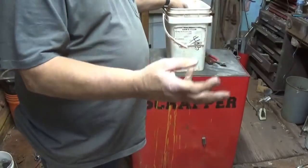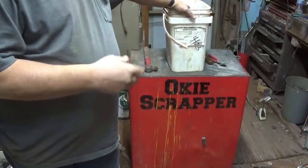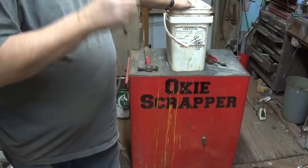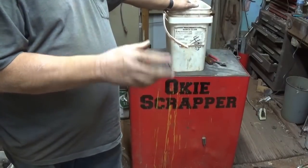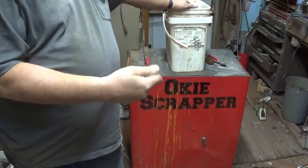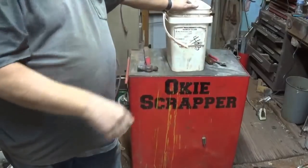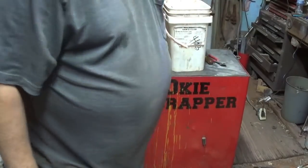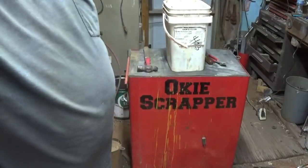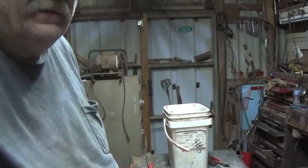But as the aluminum drips down through the hole, sometimes you get ash and other crud dripping down in there too. So those cupcake ingots aren't real pure. So what I do, I try to remelt them down in a crucible, and then I can scrape the dross off the top, the impurities, and then I can pour nice clean ingots. I guess you can watch the video and see the ingots I pour.